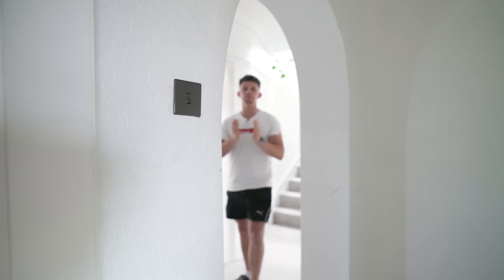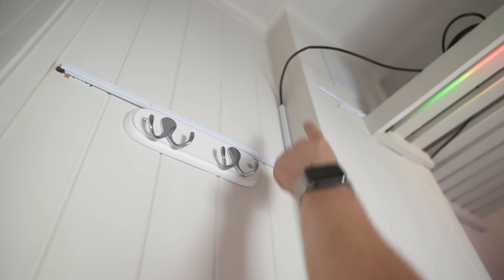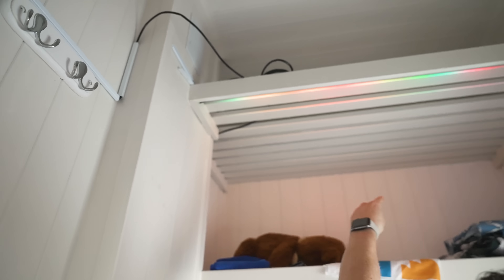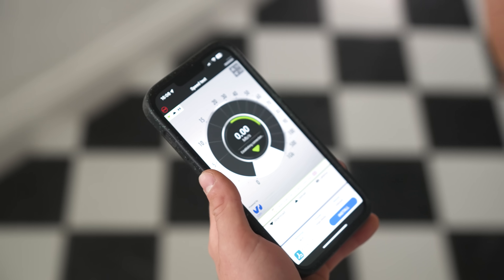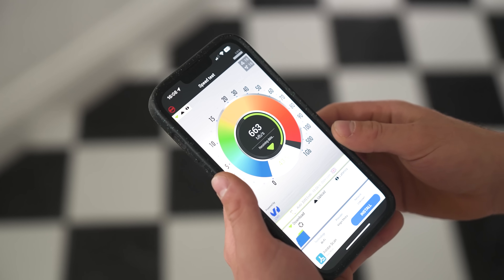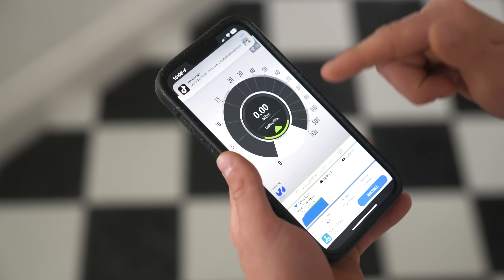The last of the four access points is in the middle of my house. This part of the house is actually three stories and we're on the middle story, which is why I've placed this access point here — it covers this floor, the floor above, and the floor below absolutely fine. Wi-Fi AP placement makes a massive difference. It was difficult to place — I had to drill through the wall with a very long drill bit, the cable comes out into trunking, goes outside, and then back to the main server rack. Coming down to the first floor, we are pulling the entire 700 meg of my internet connection. These Alta APs are seriously amazing.